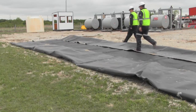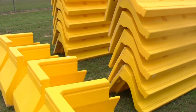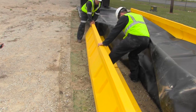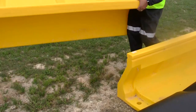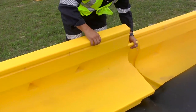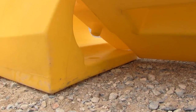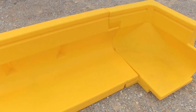With the liner unfolded and laid out to the approximate system dimensions, the straight wall sections and corners are now ready to be brought in and connected to form the structure of the system. The all-polyethylene, roto-molded sections are durable enough to withstand the daily rigors commonly seen on site, but lightweight enough that they can be installed without lifting equipment. The walls and corners lock together quickly and easily without the use of tools, by inserting the molded-in peg of one section into the hole of the adjoining section, so the pieces are securely connected.